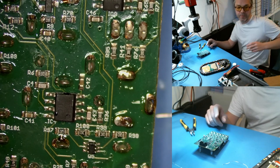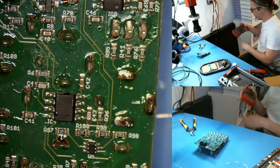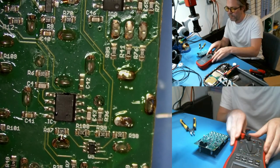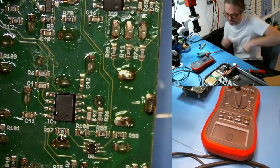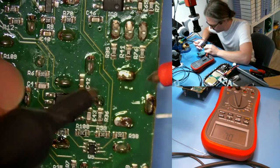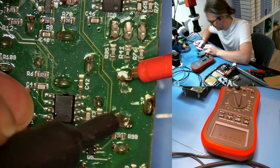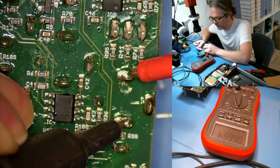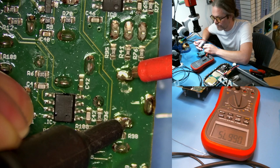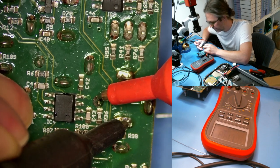I want to use a multimeter — this is optional, just to check your work. We're going to use resistance mode. What I'm going to measure is from the switch to the tip, and what we're looking for is that resistance — in this case 6.8 kilohms. It's measuring 6.6 kilohms, but roughly 6.8. Then you want to check against ground, make sure it's non-zero — there's no bridge to ground. That certainly won't be if we've already done this.